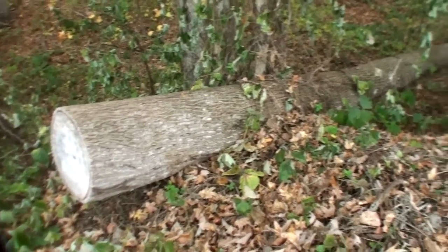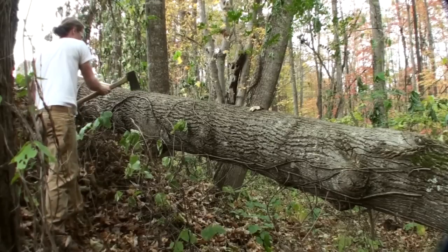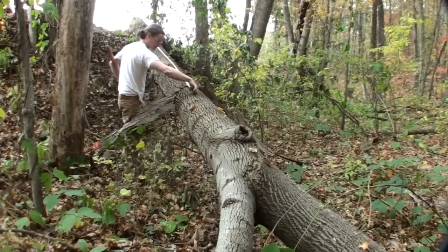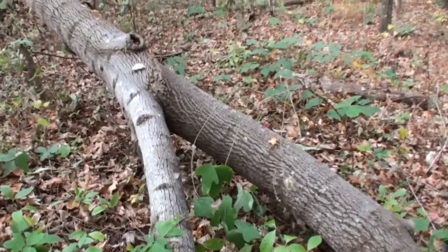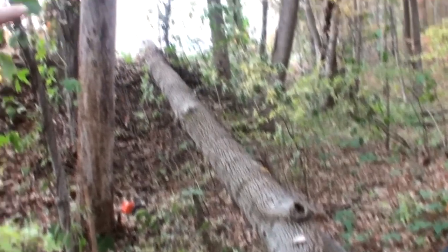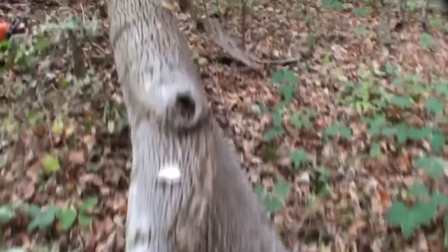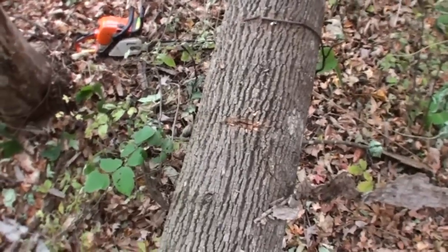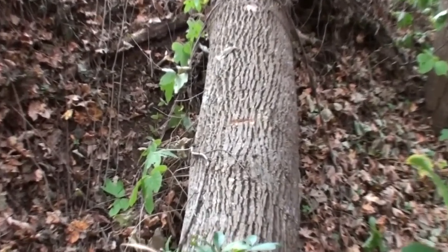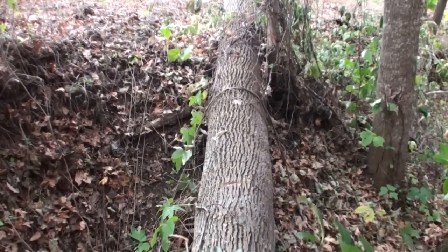With a wood like poplar it's a pretty stable drying wood. This is a young tree so it'll have a little more growth stress in it, but even then it's pretty stable. I just went six inches over, so this gives me three inches on each end for any kind of checking or cracking — you might want to add a little more for less stable woods. The top of the tree is laying on the ground with the remainder suspended, so I'll make a cut to drop the tree a little lower, then cut at my mark. Each section is going to be 12 feet 6 inches to try to get 12-foot siding boards out of them.